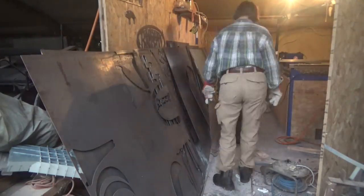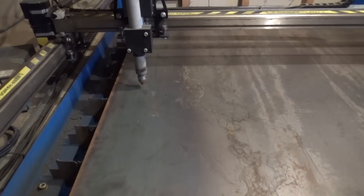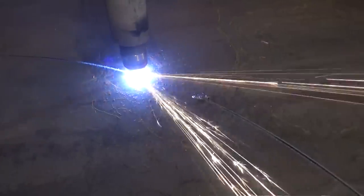The tidying up fairy hasn't been around for a while, so it's a bit of a mess and a struggle to find the pieces we need. The top plate is simpler — it's just a plate with a hole — but I want it to be more rigid so I'm using 6mm steel. This is the thickest steel I've cut with my machine so far, and it's very heavy and expensive. Unfortunately the first cut went horribly wrong; the electrode burnt out halfway through and the cut was terrible. But I replaced the tip, the electrode, and the heat shield, which was wrecked, and the next cut went perfectly. Getting through consumables is the only problem I have with this machine. The software is really easy to use, the machine itself is perfect, but it does get through tips especially. But when it's all working, it's very satisfying.